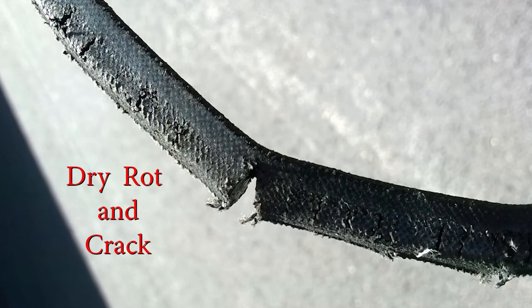From the chain drive you get into the large pulley and the small pulley on the electric motor, connected by the rubber pulley belt. These tend to go bad because we're dealing with a hot, dry environment and in many cases they don't get a lot of use, so they dry rot, start to split, and come apart. When one of these belts actually fails it's not a good thing because it's part of your brake system as your door is coming down. If that's eliminated, the brake on your electric motor has no function and that door in some cases can actually freewheel all the way to the bottom — not something you want to happen under a one-ton door.